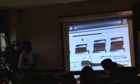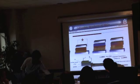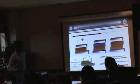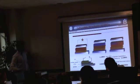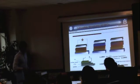These are nothing but a blend of all the structures. Here's just a small template. The bottom layer would be a glass slide, and on top of it would be the ITO or indium tin oxide, and then on top of it the active layer or the conducting polymer, like PEDOT:PSS. And upon that, we need some kind of metal contact in order to capture those charge carriers.